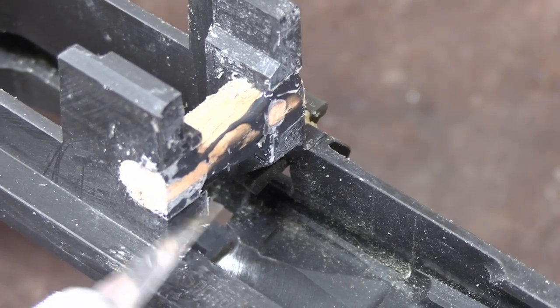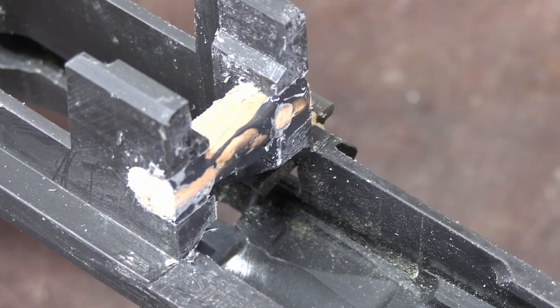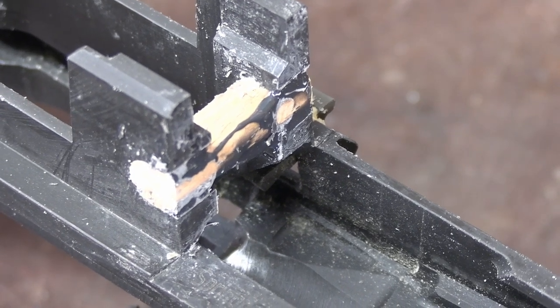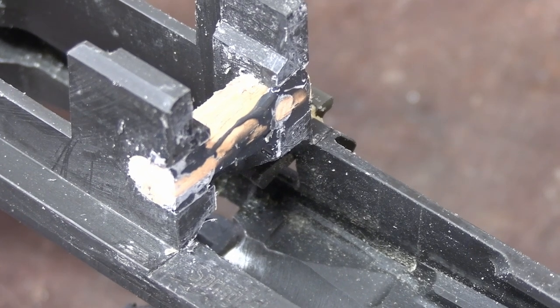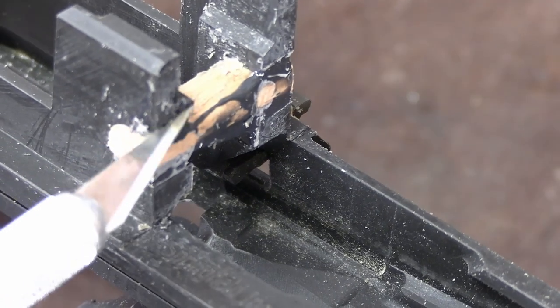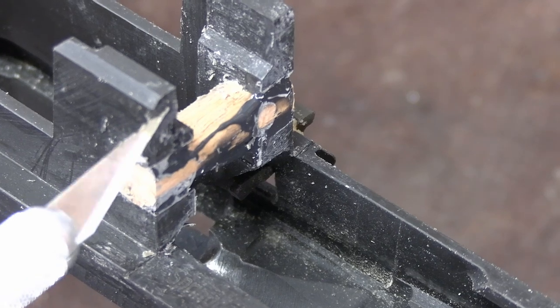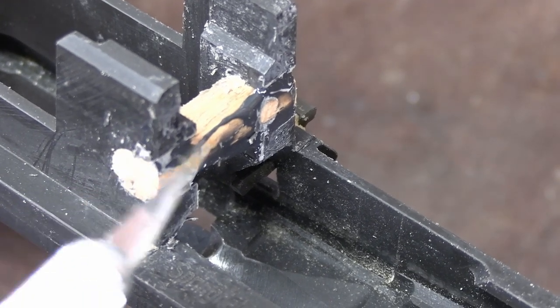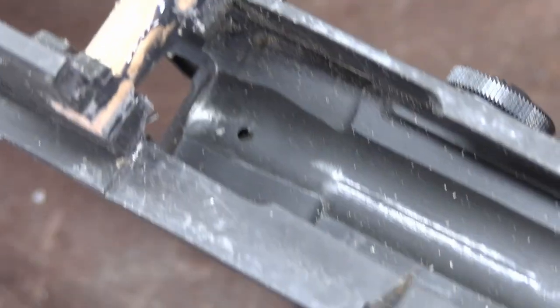Don't add epoxy in between this, because adding epoxy is going to be a fragile surface. No matter what you do, epoxy will not adhere to steel that well. It'll break apart like glass. So you want to avoid adding any material in here. If some happens to weasel its way in because there's a flaw in the steel, that's fine, but that's not altering the dimension.